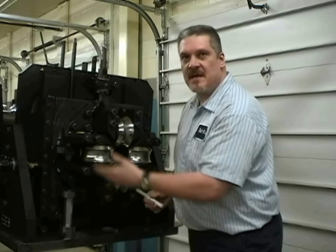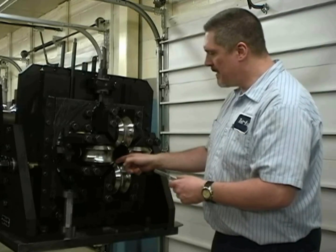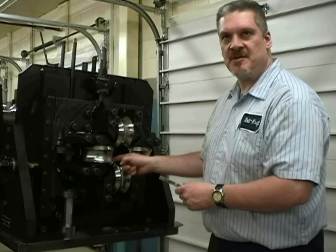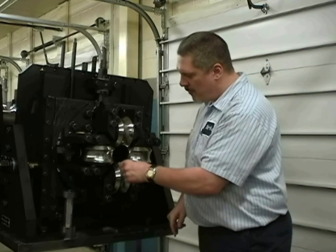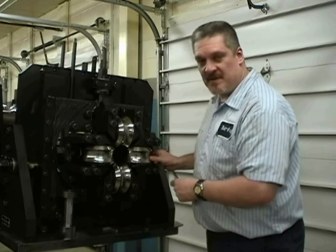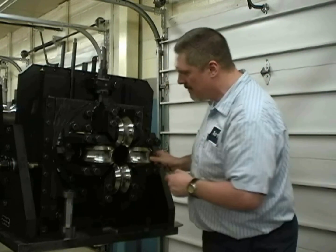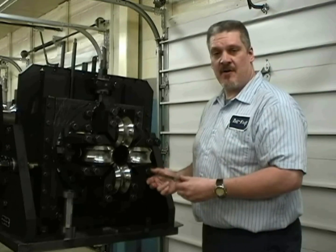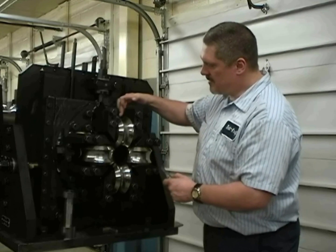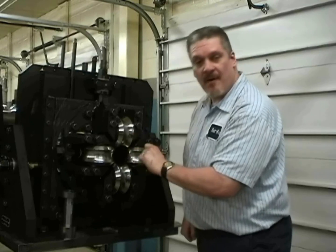You may have to go back and forth several times. Keep in mind if you're making those clevis adjustments, you also want to periodically check the flanges here with your finger to make sure it's a nice smooth transition. Once you've achieved the proper gap setting, move on to the other side and repeat the process again until you achieve the correct gap setting on that side as well. If the alignment and integrity of the rolls is good, once you've done these three rolls, you should just be able to bring the top roll down and the gaps should be equal all the way around.